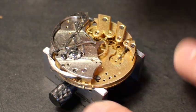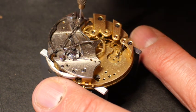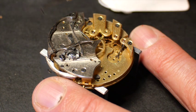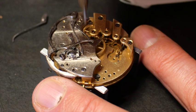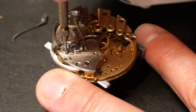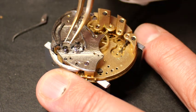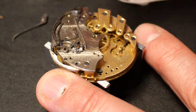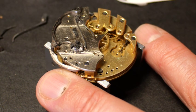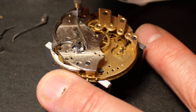Let's move on to taking off these springs — there are about six or seven of them. We'll just go through and take off what seems logical, keeping all the screws with each spring as I take it apart because it looks like these are all custom fit. Spring number one, then number two — that looks like it's the ratchet wheel spring. Then spring number three — that's the ratchet wheel click.